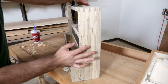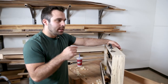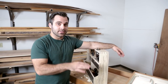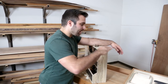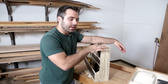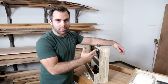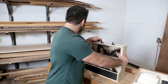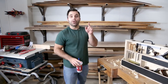If you're thinking about working with spalted maple like this, depending on the severity of the spalting, it can make your life difficult. Dovetailing it is tricky because there are hard parts and softer parts of spalted maple. When I was paring my tails down and getting them flush with the case, I did have some breakout associated with the material actually crumbling — not because my chisel wasn't sharp enough. Very sharp chisels will help a lot, but it's not perfect — it's also handmade.